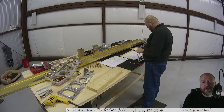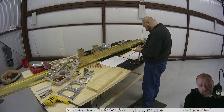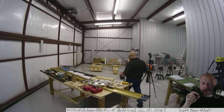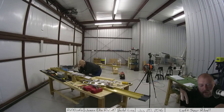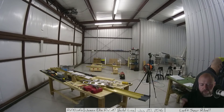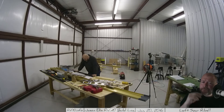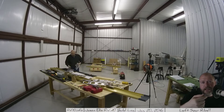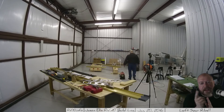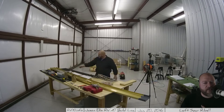You also have to cut two ribs. One of them you have to cut a piece off so that when it slides into the spar itself it matches up in such a way that it does not sit on top of one of the nut plates in there — real simple, as soon as you put it in there you go, okay, I see what you have to do. And one of the other ones you have to cut off the very tip, because it's got a tapered shape and that flange that curves around — you've got to cut part of that flange entirely off on the very far end. I vaguely remember it had something to do with the fairing, but I've forgotten — I kind of thumbed past it real quick.